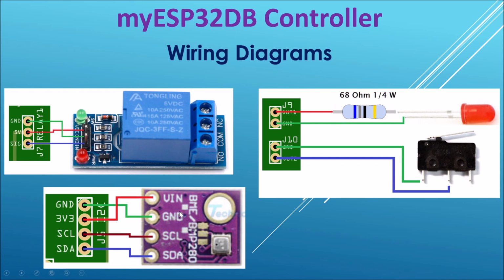And here's an example of connecting a BME280 device. It's an I2C sensor connected to J5, the I2C connector: 3 volts to VIN, ground to ground, SCL to SCL, and SDA to SDA. These sensors, even though they're rated at 5 volts, will run quite happily with 3.3.